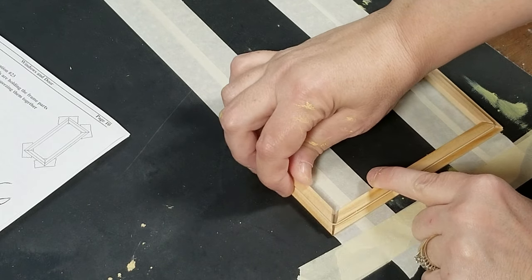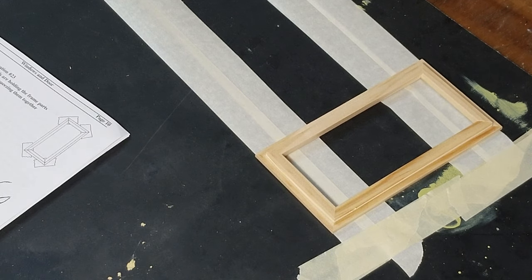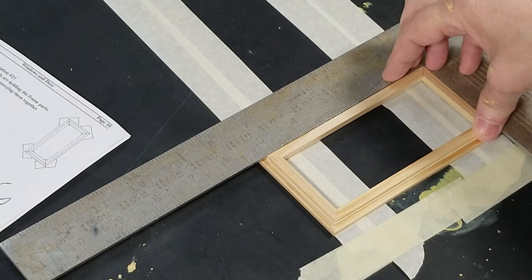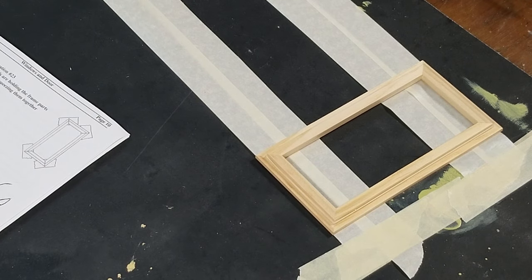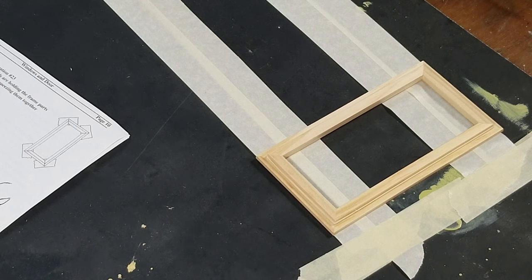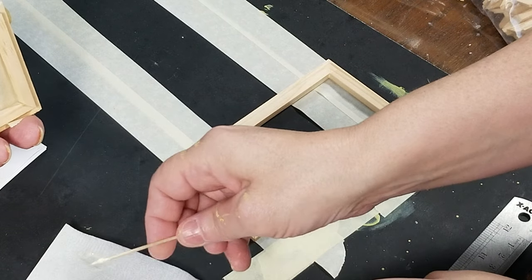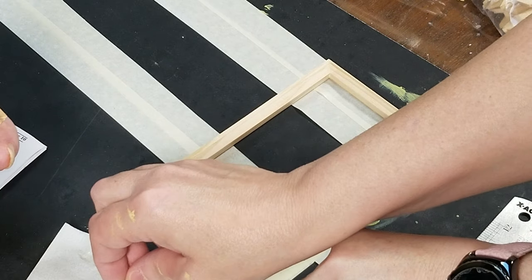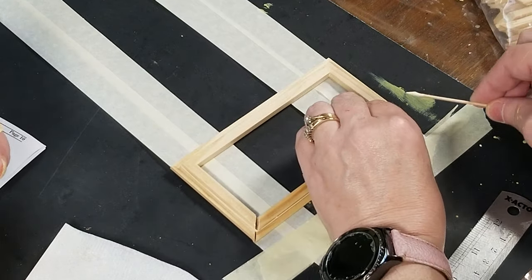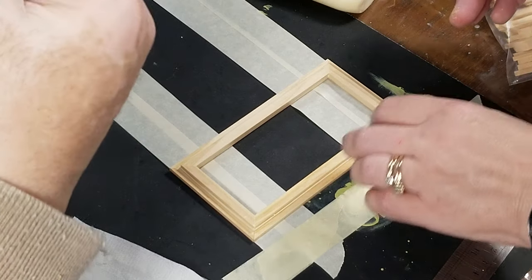So we're going to glue these together and then go ahead and start assembling the shutters if the other stuff isn't dry. An easy way to get the glue in there is to take a toothpick with some glue and just put a tiny bit on there. When you spread it open and slide that down in there, then push it back shut — your glue will be in there. When you get to the end of putting all these together, you're going to have a bunch of little pieces left over — that's for this window here. Go ahead and glue them together; this way is a lot easier.